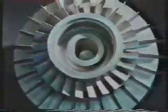If small numbers of specialized castings with high tolerances are required, made of high melting metals, then investment casting is frequently used. It's an ideal method for light alloy materials which need good dimensional accuracy and little final finishing. It's just the thing for making bioengineering components like these artificial hip joints. It's also widely used in the aerospace industry for all sorts of components. This support strut is a typical product of investment casting.